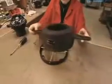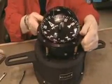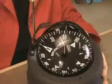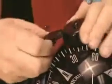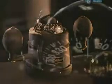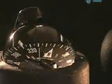A metal housing unit is mounted on the base, then shock absorbers are attached to cushion the compass against vibrations. The compass is installed in the housing, and tapping the dome tests the shocks. A decorative aluminium cover fits around the dome, and a light is installed to allow the navigator to see at night. Iron spheres are attached — another tactic to counter magnetic interference. Our journey through the plant is now over and the compass is ready to set sail.